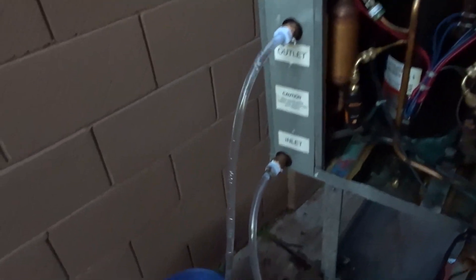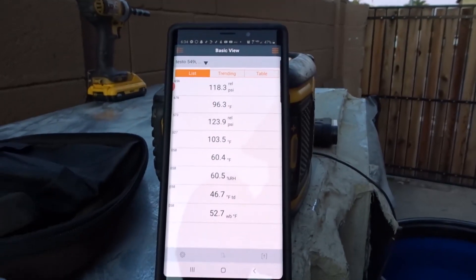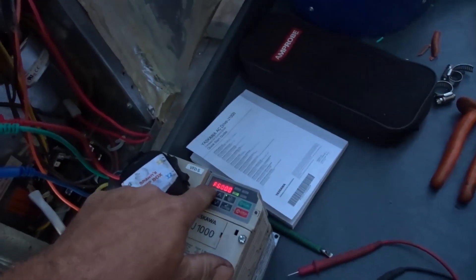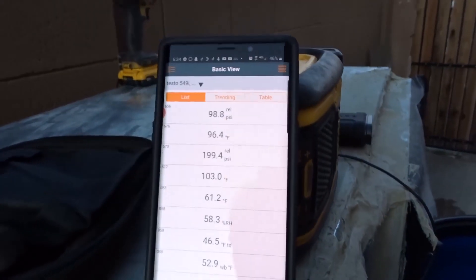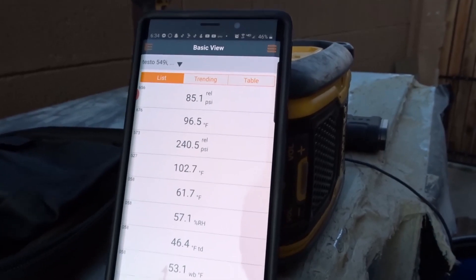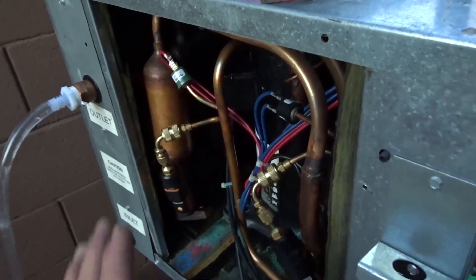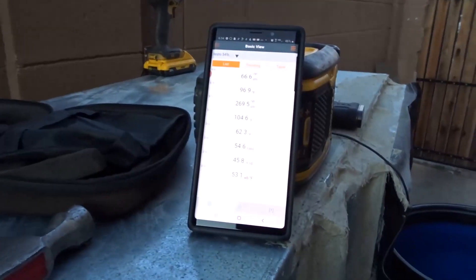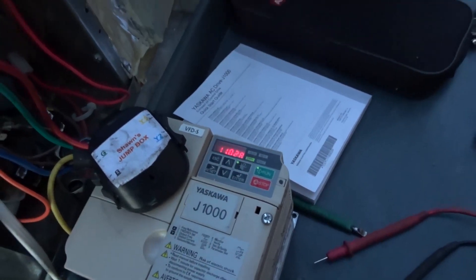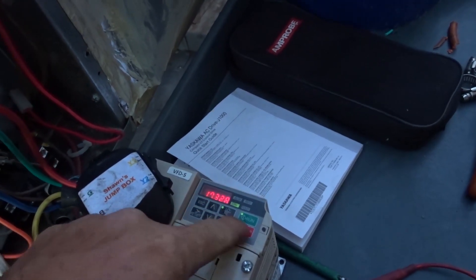More mechanical inhibitors there. The water temperature is 96°F now. Wonder if this will restart if I turn it off in time - yeah, there it goes. With the water temperature up in the 90s, the head pressure is climbing pretty quickly. It's definitely lugging this compressor very quickly being under voltage. The amps are going to be ridiculous - 10 amps. I did set the amp rating for about 9 or 10 - surprised it's not going on overcurrent - and there she goes, it's pissed.